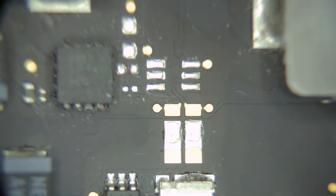It's one of the only things that will kill this board is an exploded CPU. But let's take a look. This is what I want to look at over here. This was supposed to be a current sense resistor. There is one right here. This was supposed to be a current sense resistor. The current sense part is not stuffed because this was a development current sense. But this is just solid.